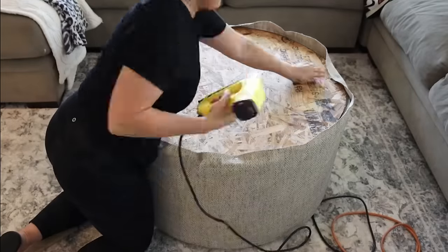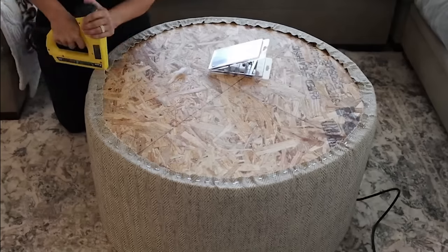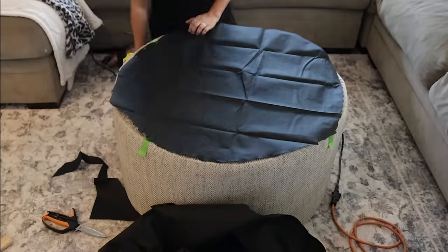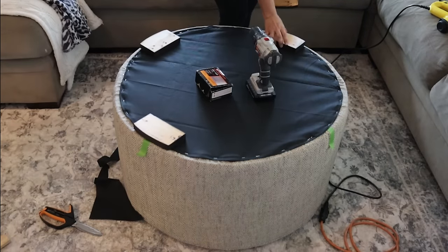Flip your ottoman over and staple on the bottom — just make sure you don't over-pull. There were a couple of areas where I felt I may have pulled the fabric a little too tight. You want it firm but not so firm that it's pulling funny on the foam. This next part is totally optional, but I felt it gave a more professional finished look. On the bottom I got some black upholstery felt that you see on a lot of upholstered items and stapled that into place in a circular fashion. It gives it more of an official piece-of-furniture feel, even though nobody's really going to see the bottom of the ottoman.